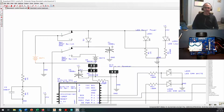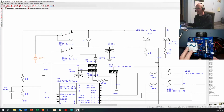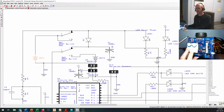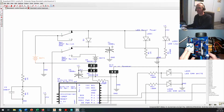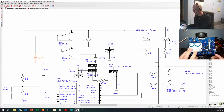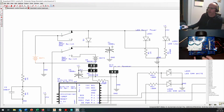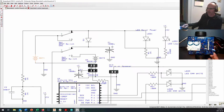Okay, and the challenge that we run into is that our battery pack inside the Arduino here for the motors is 4 AAs, which works really nicely. It gives us about the right voltage for the motors that we're using. Yeah, somewhere around 6 volts when everything's fully charged and working really well. But as you'll know from our mini sumo project and some of the calculations that we did in there, when motors start up, they draw a lot of current. And batteries have internal resistance.